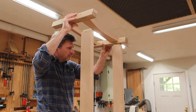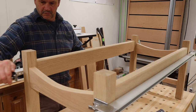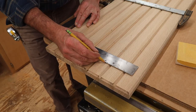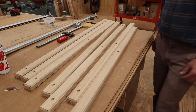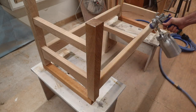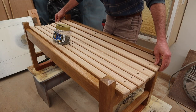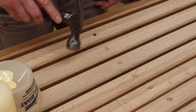I'll start with the back rails. Now I'm ready for finish, and for this project I'm using Total Boat's Amber Halcyon. I'll finish the bottom of the slats before attaching them to the bench. After spraying a few coats on the bottom of the seat slats and the bench, I'll attach the slats — first attaching the end pieces, then the center, and then the two pieces between the end and the center, making sure they're evenly spaced.